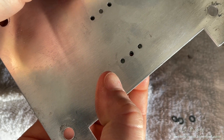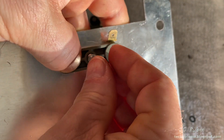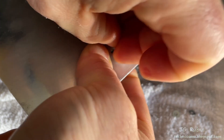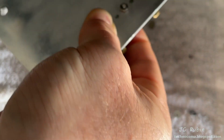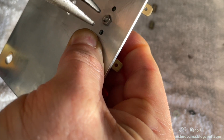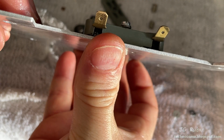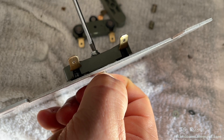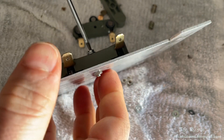It's easy to lay the plate onto the diodes so they don't fall out. There's a small mark that aligns the hole just to the right; pressing down holds everything together. Checking that everything's still in place, the spring is dropped in, followed by a screw and washer of appropriate size. A nut goes on the other side with just a couple of turns to hold things in place. Using pliers I turn the nut a little further so the spring doesn't shoot out, then use a flathead screwdriver to compress the spring flush with the plastic so the diodes are tightly seated.